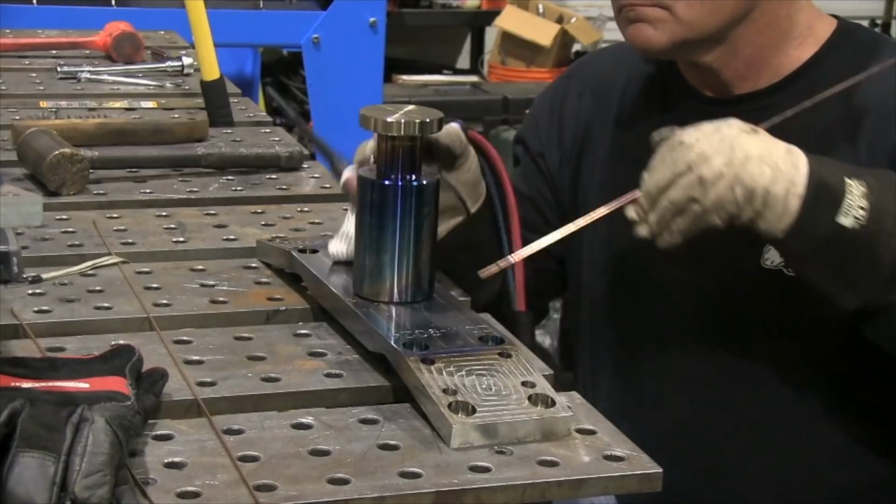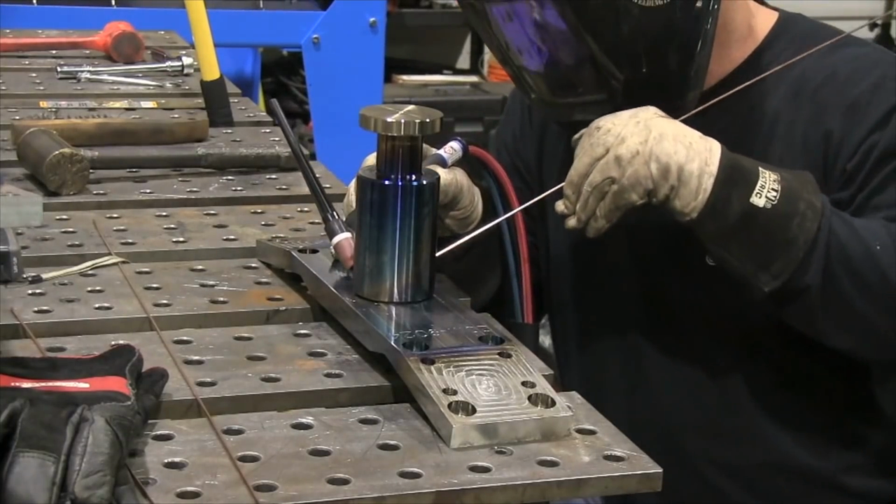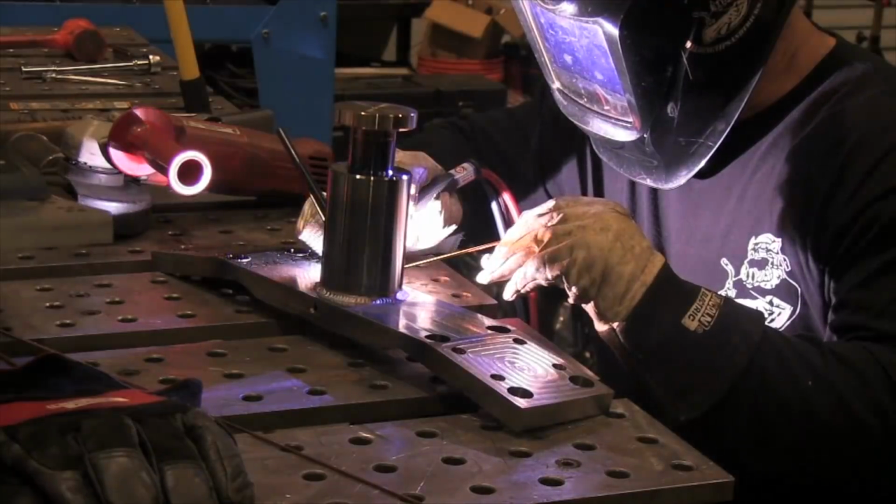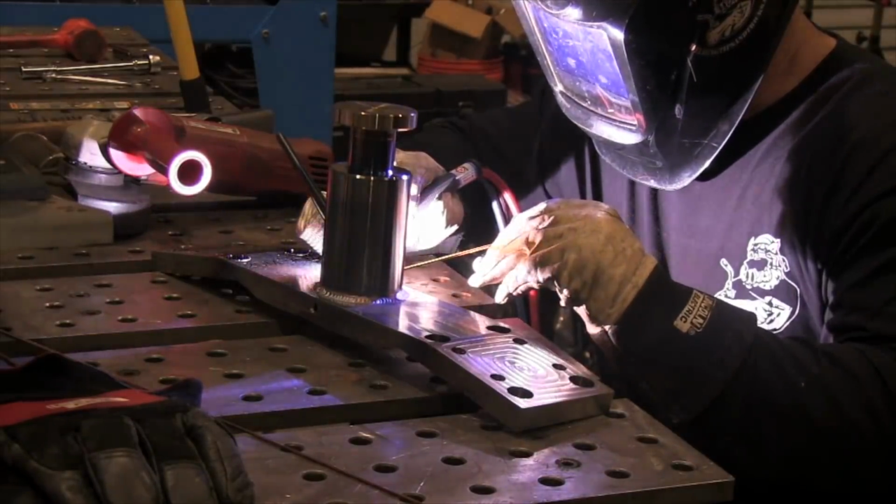And when you're welding hot like that, Tig Finger really does come in handy. Shameless plug, but I love this little clip here. Again, I'm doing about 165 amps here if I remember right. Just leaving the wire in the puddle, soaking it in there nice and slow. Don't want any real fast cooling or any real fast travel speed here, because I want to keep the heat up on this part. And then the same thing I came across with a second pass here to get the adequate weld size.